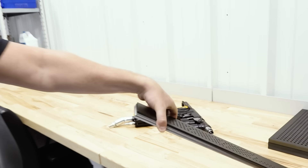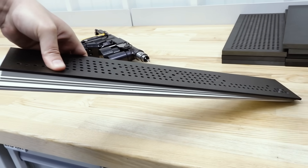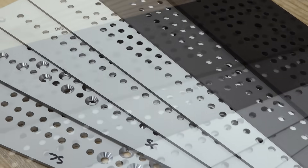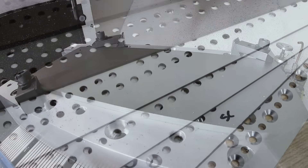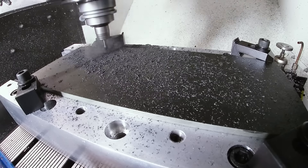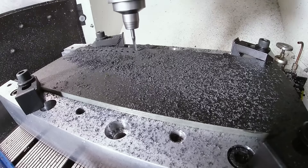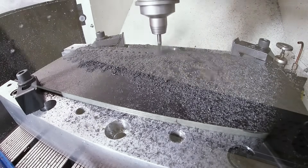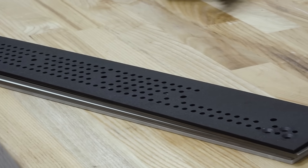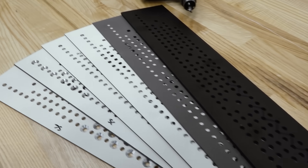So this is actually an example of a complex application for aerospace final assembly, where they're putting components together and having to drill through different layers to join the materials together with rivets or whatever fasteners they're going to use. In this example, we had to drill with one tool through CFRP, four separate layers of titanium, and exiting in aluminum — all while still meeting the customer's requirements for bore diameter, interlaminar burr, exit burr, and surface finish. The additional challenge is that with the drill motors they were using, their ADUs were pneumatic, so you have a fixed feed and speed. Instead of transitioning feeds and speeds through the different materials, you have to choose a fixed feed and speed to accomplish your goals — with a single tool, through all that material, and no burrs.